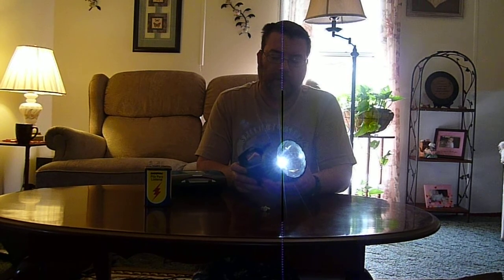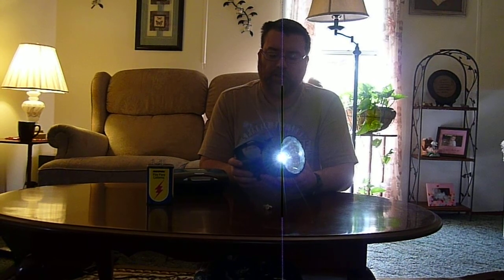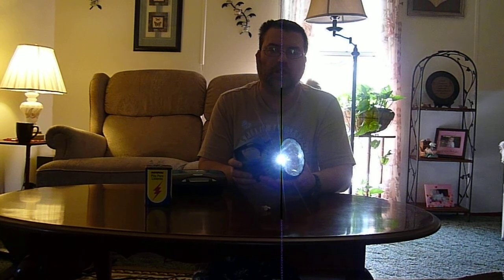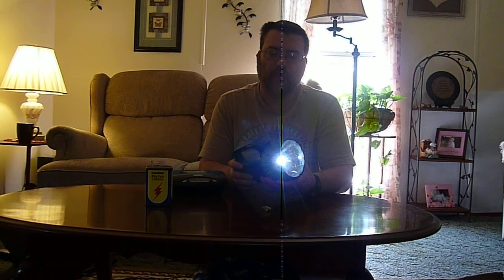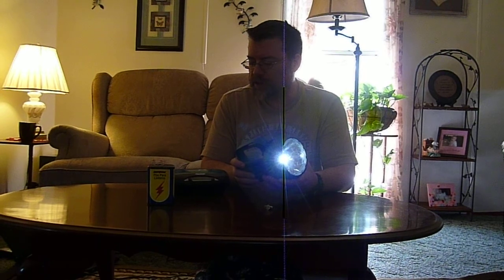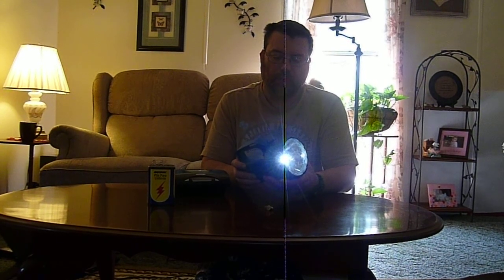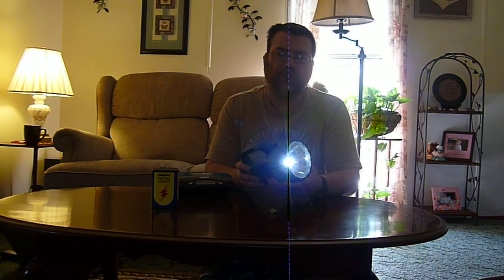So that is our quick and easy conversion to a long life LED. The bulb will never burn out in this particular application — there is a voltage regulator in the bulb. The batteries will last for years and are rechargeable hundreds and hundreds of times. You should easily get five to seven years out of these batteries. And they are very low self-discharge batteries, so if you have them sitting in a drawer for a year or so they will still have charge on them when you pop them into the flashlight.